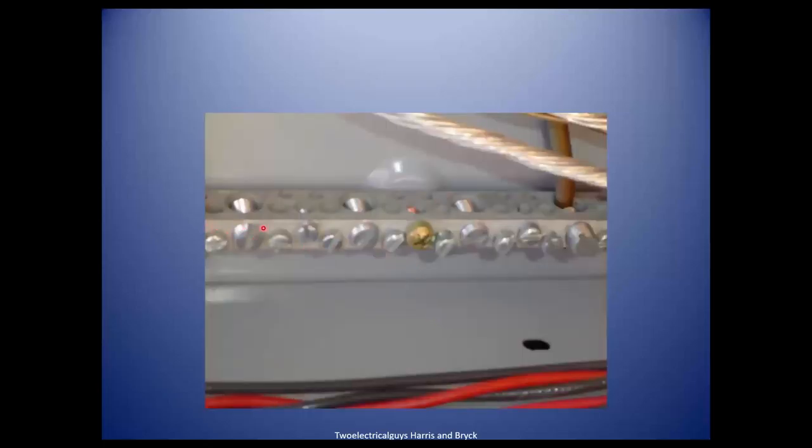This bar has different size holes with different screws. In most of these panels, there's enough room to put one wire per lug if they had to. Are we required to report on the source of grounding? You have to report that you can find a ground. This solid number six wire is the grounding method — you can see it, but we don't know where it goes.